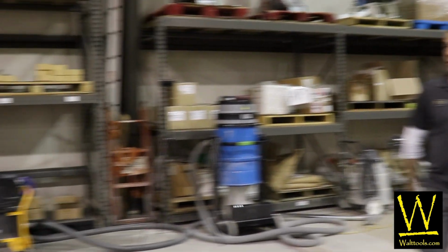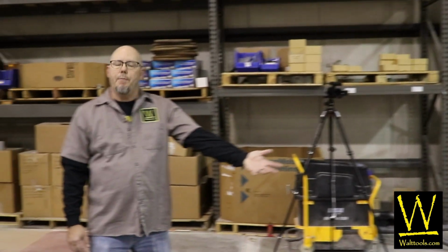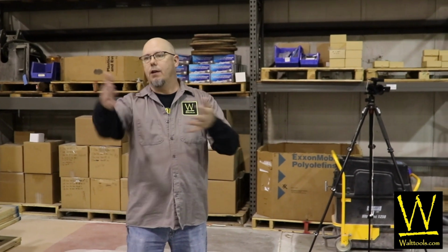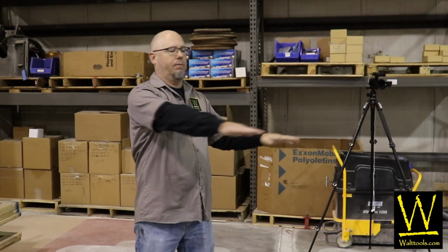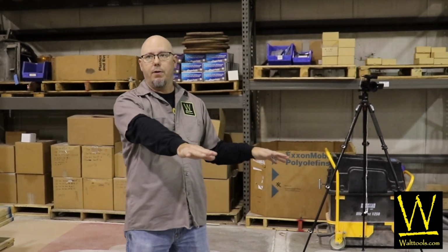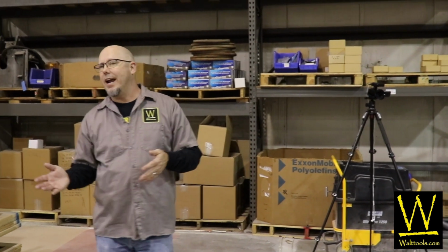In our case, because we're black background, we're not putting down white. Our glue coat is going to be black, so we won't have those shadows. This is just going to be a jet black floor, which is perfect. The quartz I have is actually on a lighter side, but it's a white and black. So as long as we get our quartz broadcasted very evenly, we should really have no shadows coming through.